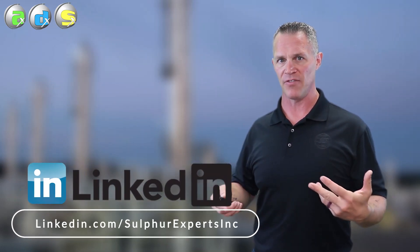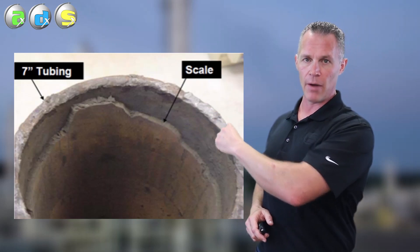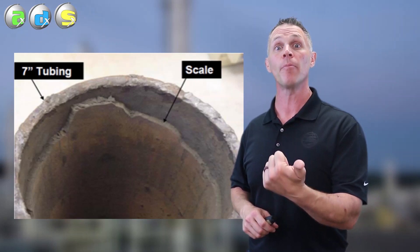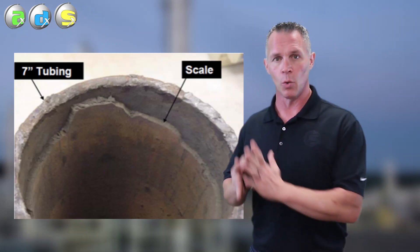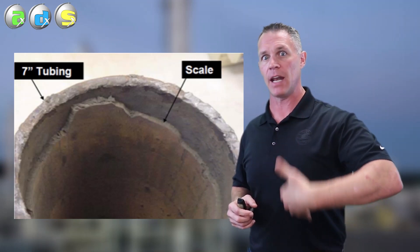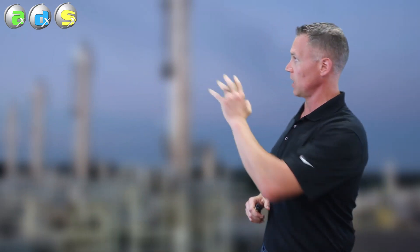You hear the term "protective iron sulfide film" - or passivating film, some people call it, though it's actually not that passive. But as far as preventing further H2S attack goes, the one that we want is pyrrhotite. Pyrrhotite works to prevent future H2S-related corrosion because it is non-porous and non-soluble. So once it forms on the piping wall, it stays there and creates a barrier between the amine and the acids within the amine and the piping wall itself.